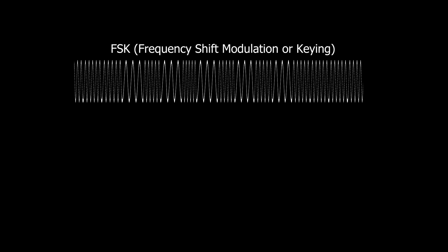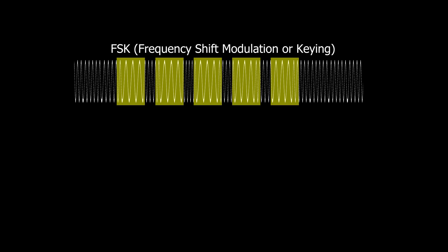Let's visualize what we've learned. The audio coming in will be modulated using FSK — frequency shift modulation — a method of transmitting digital signals using discrete frequency changes. Looking at our audio signal, you'll notice different frequencies represented: parts of the wave that are spread out are the lower frequency, and parts closer together are the higher frequency. A one or mark is at 2400 Hz, and a zero or space is at 1200 Hz.